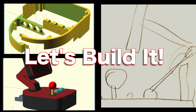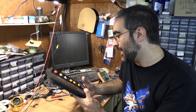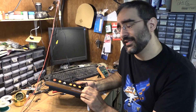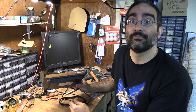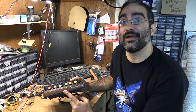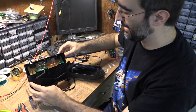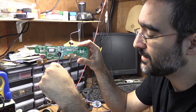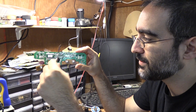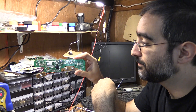How do you make these things? This is the Atari Flashback 2 — this is what powers the G2. When you buy it, it comes with 40 built-in games, pretty good games actually. But of course we want to be able to stick in cartridges, so the magic is adding a cartridge slot to this. That entire box is actually the Atari itself — it emulates the 6502, the TIA, and whatever the other chip was called. This thing up here is kind of like the built-in cartridge with the 40 games.